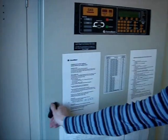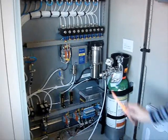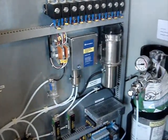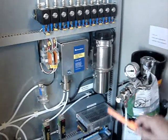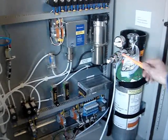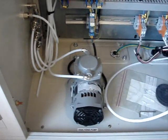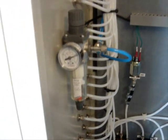The analyzing unit of the gas sampling system is located inside the cabinet. The analyzing unit consists of two gas detectors: one is used for measuring the hydrogen sulfide, and one is used for measuring the hydrocarbons. It also consists of a span gas bottle with a manometer and a shut-off valve, and the analyzing pump, which constantly sucks air from the sampling points through the piping system located on deck.